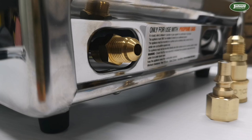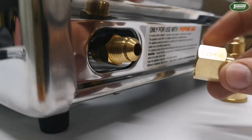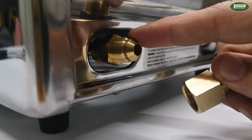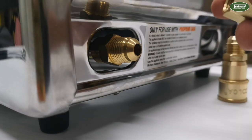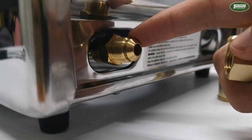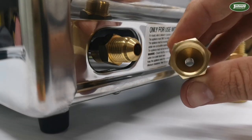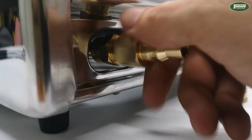Now the smaller piece of the gas connect fitting — this one here — screws onto a gas end called a 3/8 fitting. You'll find the 3/8 fittings on most low-pressure gas stoves; you can find them on hot water systems and also on barbecues. A 3/8 fitting looks like that, and so this female end here will go onto a male end and screw on like so.